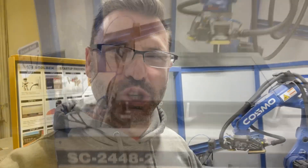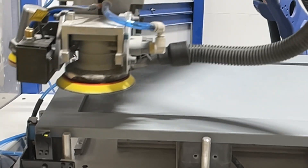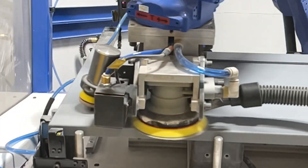Now I'm going to demonstrate coming on a little bit too soon. At full speed you've got to be pretty quick, but let's slow it down and watch — the sander starts to wind up before it touches the part. And if you do that, you get some sand-throughs.